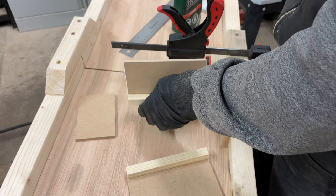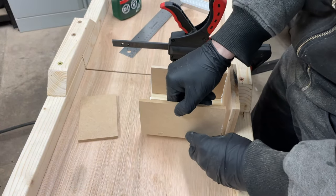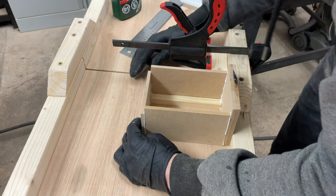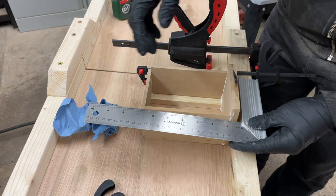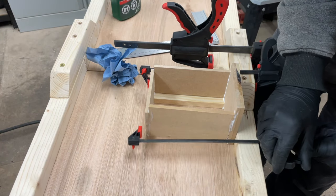Building the speaker boxes was much like building the base cabinet. I cut out the wood panel from 6mm MDF, and then I attached some 15x15mm squared dowel to the side panels at the back for support. And after that, it gets glued and clamped together.